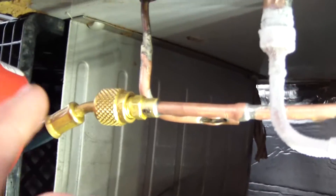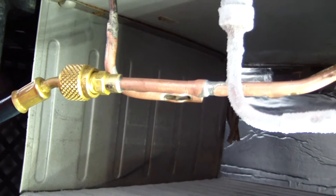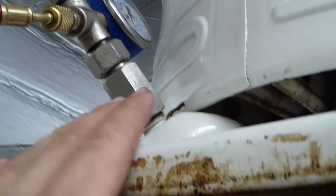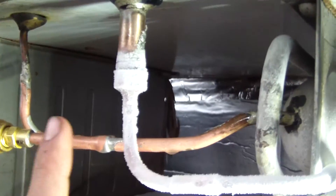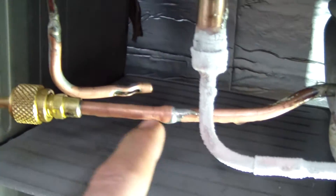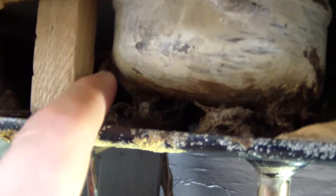So I added a low-side port for doing some of this work, and ultimately I'm going to put in a high-side port down here too, so there won't be any need necessarily to use that original one. I did that by cutting into this bypass line. This line comes off the header of the evaporator and loops around and goes into the side of the high-side float chamber.